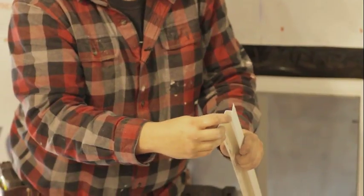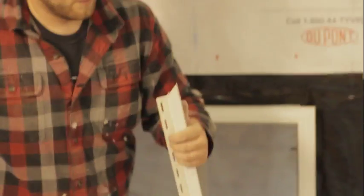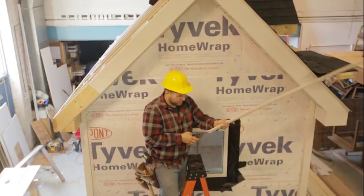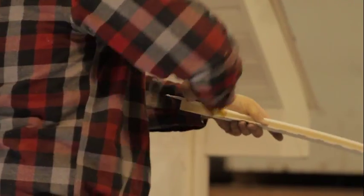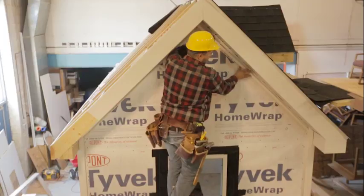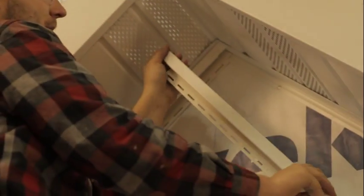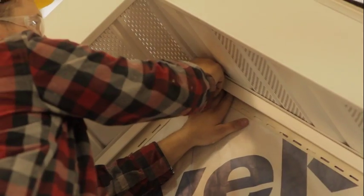There's also this little flap here that we need to take off for it to sit flat — it's just a little bit more difficult, so you try to get in there the best you can and take that flap off. Now if we took our measurements right, we have our miter on this side that should slip behind our J trim down there, and the flap we made on our J trim up here should sit right over the piece up top. We've made a nice miter at the top and now our siding can come up underneath here for a nice finished look.